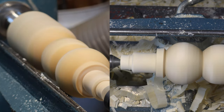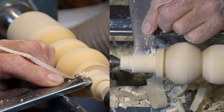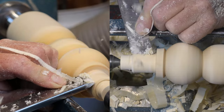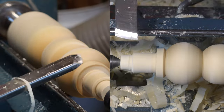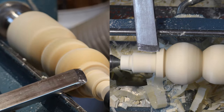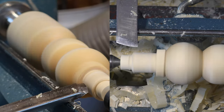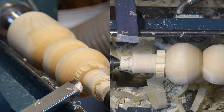Richard, I'm wondering why you don't get a catch when you put the point of the tool into the corner. Into there? Yeah. The tool is flat on the rest — there's not very much pressure going in — so it's not a place where you catch if you've got the tool flat on the rest. If you had it tilted up at all, then it'll do that. Was that the question? Yeah, pretty much so. We can blame Dave for that.